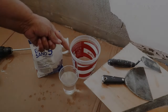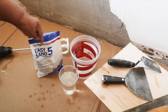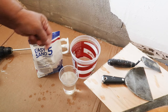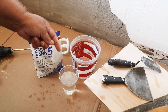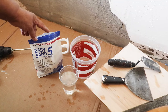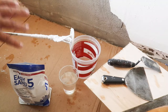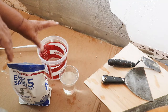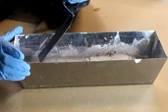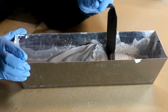I've got my water, and you want to use cooled water. Don't use hot because it'll accelerate the hardening process. We only have five minutes to begin with, so we want to use cool water. I've got my tools over here on a board. I'm going to use a drill with a mixing wand because I'm going to have to move very quickly — I only have five minutes of working time. I want to give myself as much time as possible, and if I tried to mix all this plaster by hand I wouldn't be able to get it on the wall.